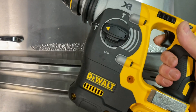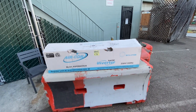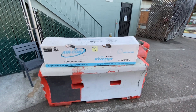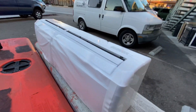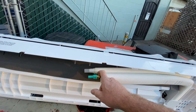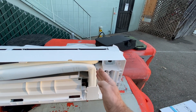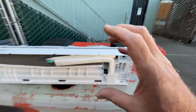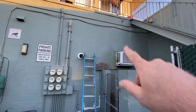This thing's really nice. Here's the star of the show — they've been getting these air cons all over town and they've been holding up pretty good. If you've seen my previous videos, there's a bunch of these running around. Got our liquid line, suction line, and condensate drain. I'm gonna massage them so they come straight out, then we'll pre-prep the electrical so when we hang it on the bracket with the hole drilled, everything just goes right through. Then we'll figure out where we want to put the condensing unit exactly, and that's the plan.